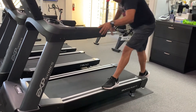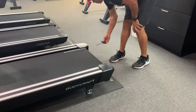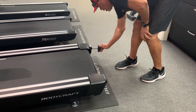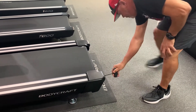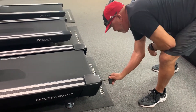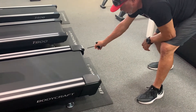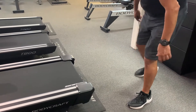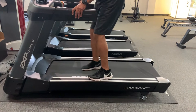So what you're going to do is walk back here. Take your 6mm Allen wrench and go on the right and left side clockwise, a half a turn at a time. The reason we do a half a turn at a time is to ensure that you don't over-tighten the belt and cause damage to the back roller. So each time you adjust, come back up to the unit and do the stomp test again.